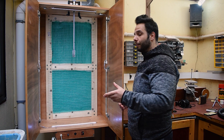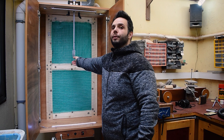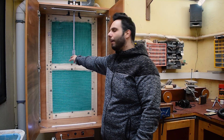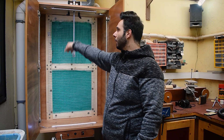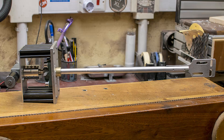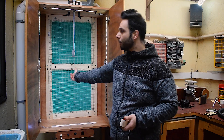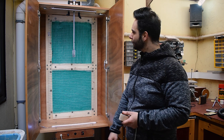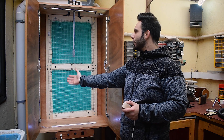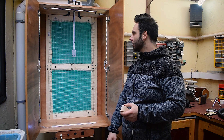A couple of videos ago, I made a video about a little gadget that was going to be used for my spray booth. That gadget is this one — this is where I can hang my work, in this case a guitar body, to be sprayed. On top there is a low-speed motor attached to a bearing flange and the shaft goes through it. With this remote, when I'm spraying, I can switch on the motor and turn the body around — clockwise, counterclockwise, and so forth.